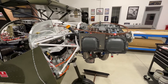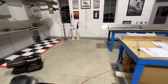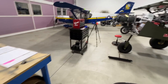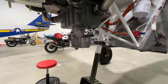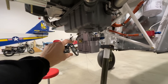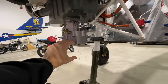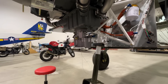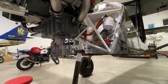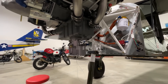I have a bag with all the spark plug wires that can get finished up once that's done. Then I'll put the spinner and propeller on. I have the cowl right here and I can start getting the bottom cowl fit. One thing I'm a little worried about is whether it's going to fit with a carburetor engine — on a fuel injected engine the fuel injector is only about this big, but with a carburetor it's much bigger with the air box. This cowl was pretty much designed for a fuel injected engine, so fitting the cowling might be a major project — or maybe there's plenty of room, I won't know until I get that bottom cowl up there.